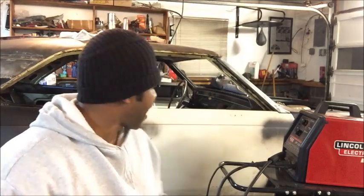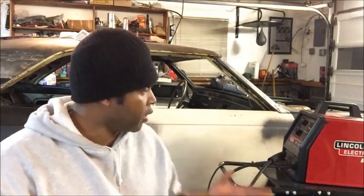All right? Come on. When you weld metal into cars that are 20, 30, 40, 50 years old, say happy birthday to the Chevelle. Happy birthday, Chevelle. It's 50. A '67. But when you weld metal into 50-year-old cars, the metal's going to be fatigued. That means it's going to be soft in certain areas. It may have pinholes. It might have holes that you may need to weld up, and that's what the weld is for as well. Instead of replacing the whole panel, if the hole is so big, you could fill those holes up.